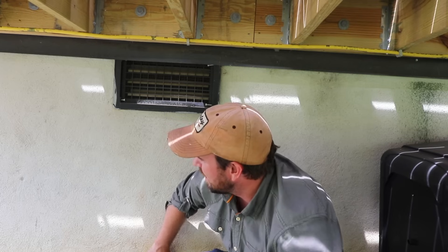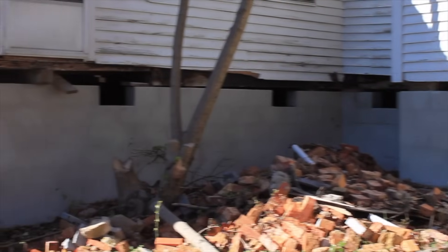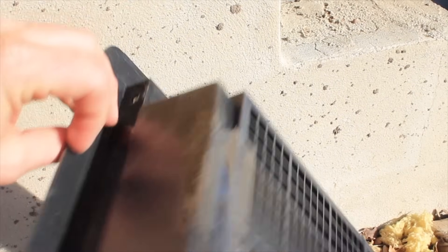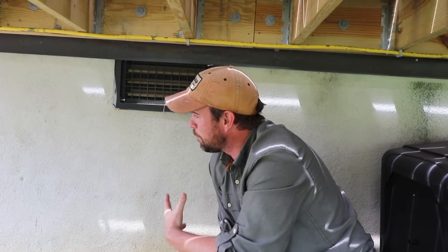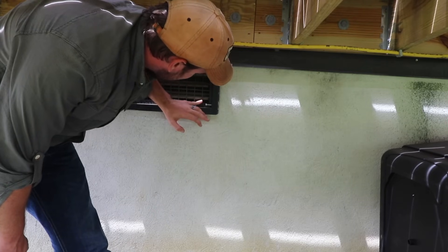The other thing to remember with your foundation is to install vents — leave a spot for them. We'll get into waterproofing in a separate video, but these vents are part of the overall atmospheric control of your crawl space. These are automatic vents, which open and close depending on the humidity underneath the house. It's important to have vents that open and close; otherwise during different seasons you'd have to manually open and close them. They're not much more expensive than standard vents, and you should have them throughout your foundation wall — we have them about every 8 to 10 feet, leaving out a cinder block for each one.